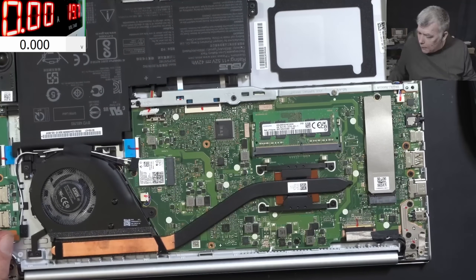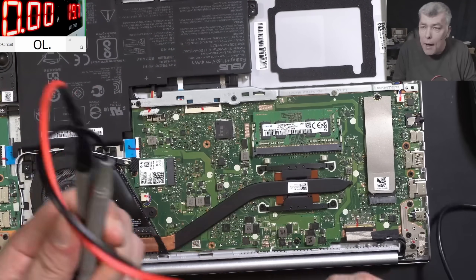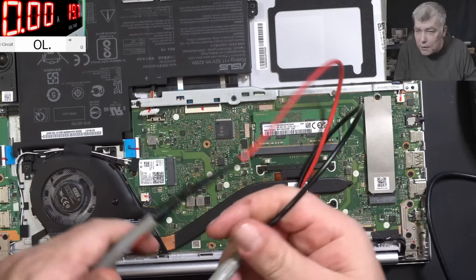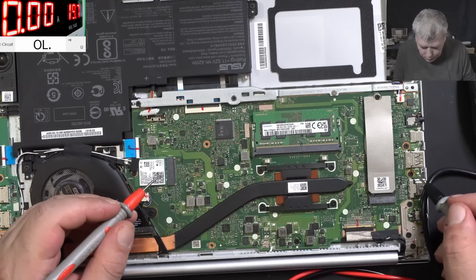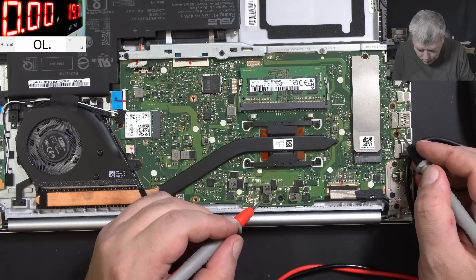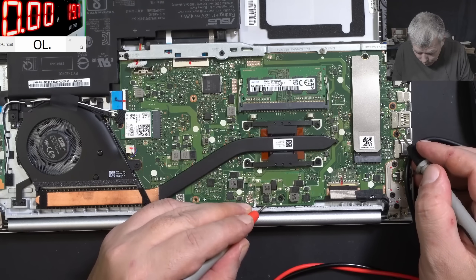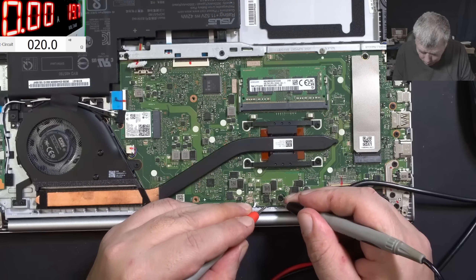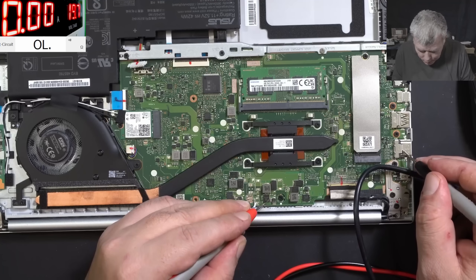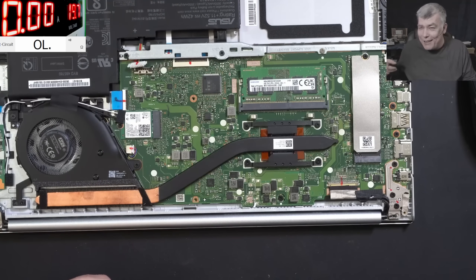We disconnect the battery. Let's see what the customer is saying - everything is shorted. I'm getting so annoyed - check here, check my multimeter wire, it's always the case. Okay so we have ground, main power rail, main power rail - yeah, power supply. Main power rail is not shorted... actually no, main power rail it is shorted, sorry. My ground was not connected. Zero ohms on both sides - so the main power is shorted and that's bad, that's proper bad.